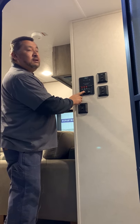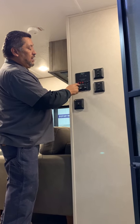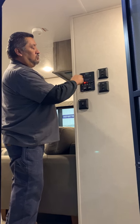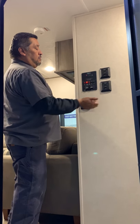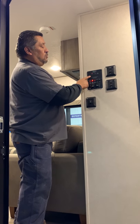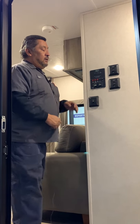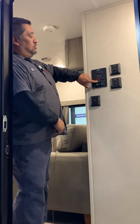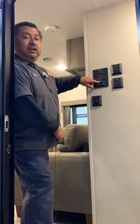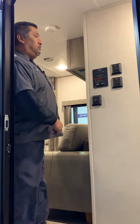The awning is going to be on here, and the water heater is going to be here. This is the gas setting — this light stays on but the fault light goes out when it's running. Once you get the propane on and get the air out of the lines, turn this on and you'll start heating your water; or you could turn it on electric from the outside. We don't want to dry-fire the tank. This particular trailer has tank heaters — if you're dry camping you never want to turn on the tank heaters because that'll kill your battery really fast.